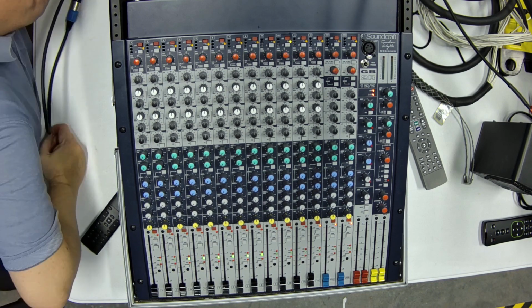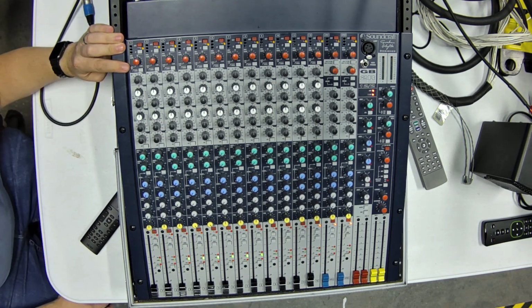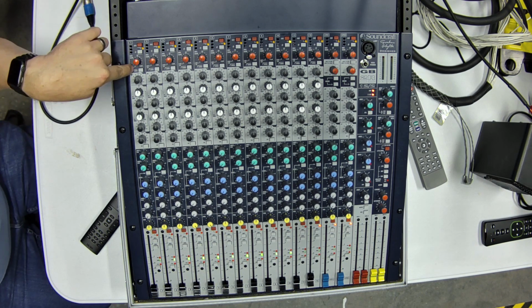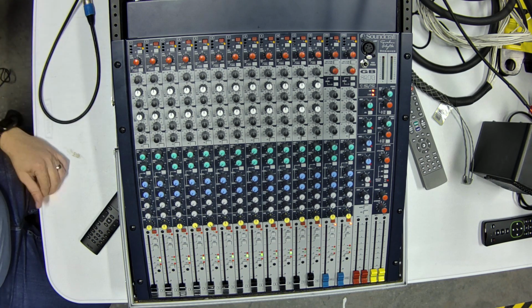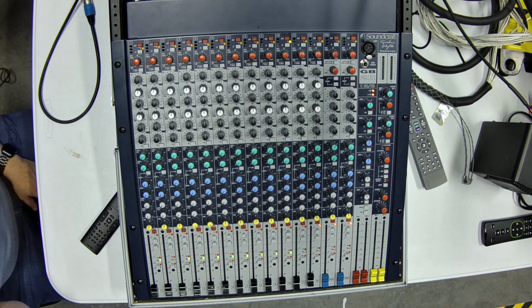But why wouldn't they just put pads on all of them? Well, each switch is going to cost you 50 cents, and you're talking about a $900 console. Then you have to punch a different hole in the thing, and that's more screen printing. There's a little bit more wire involved. It just adds up. So adding a pad directly into the line is cheaper than adding a button. Yes. Okay. That's stupid, and I hate it. Let it be known.